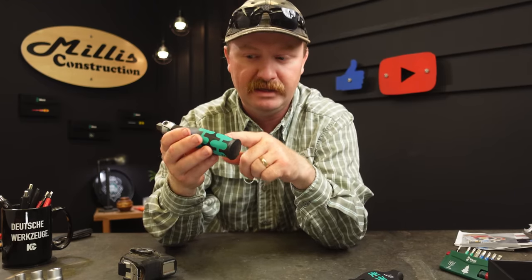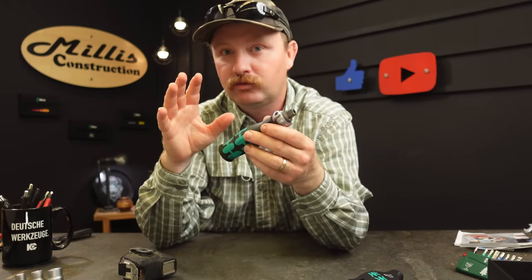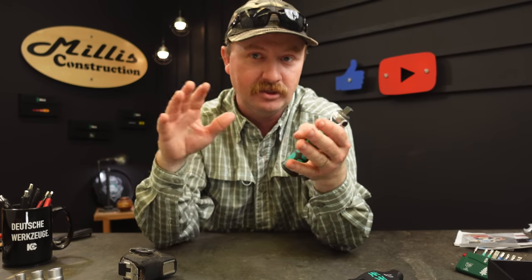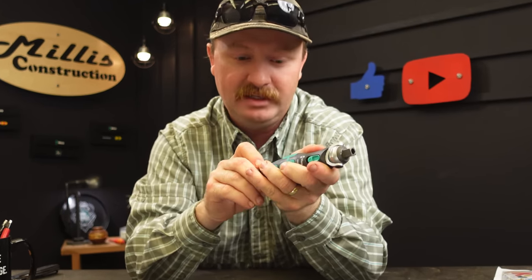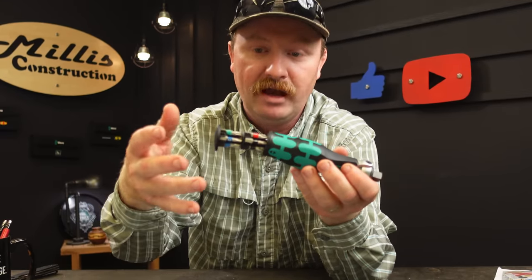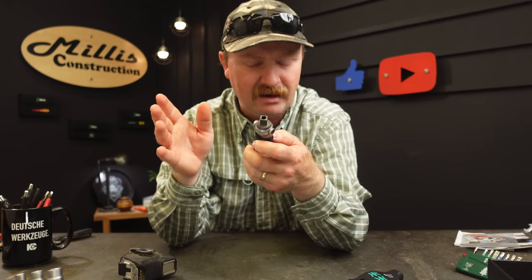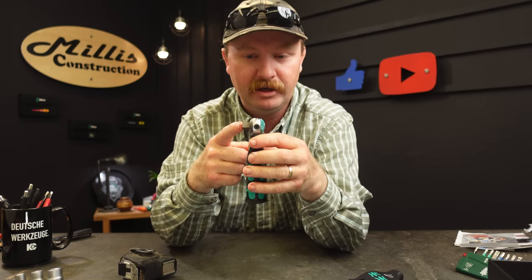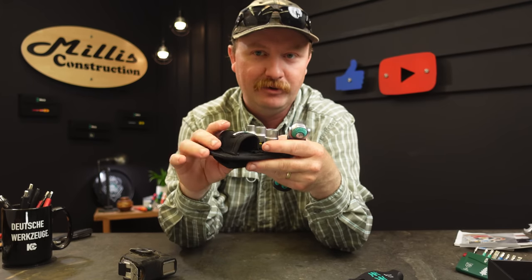You can put any normal quarter-inch bits in these ratchets — steal them from your bit checks or tool check plus sets and swap them in. That's why I really recommend starting with a tool check plus, because it has a nice range including security Torx. With double-stacked bits you've got 12 bits in the handle, which rivals the PB Swiss handle. It came with sockets in 8, 10, and 13 — and we all know the 10 is the only one you really need.